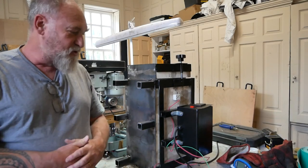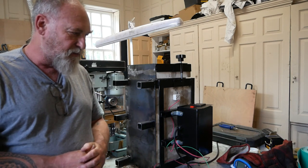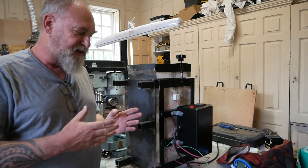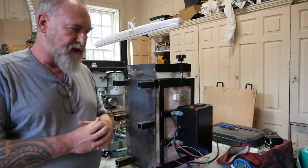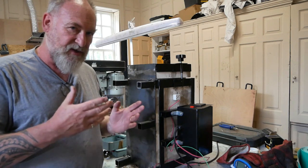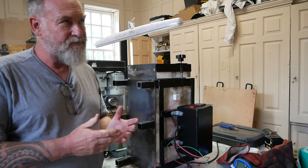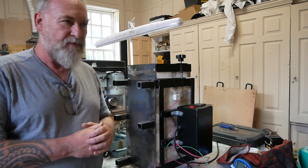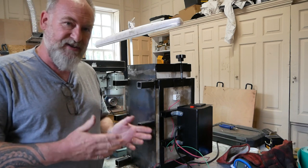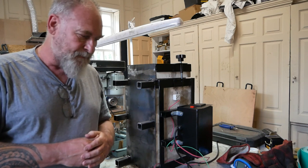Well, I'm still not out of the woods with this project. It's really giving me a problem, and the main problem is that I'm not getting an accurate reading on the PID. I leave steel at 815 degrees Celsius for quite a period of time, but it's close-ish to critical temperature, but certainly not at critical temperature. And this is 1070 steel, which should be critical at 815 degrees.